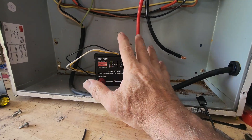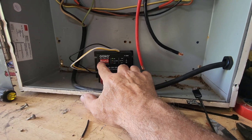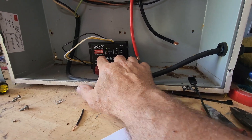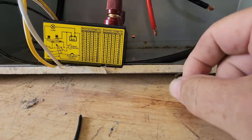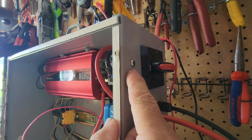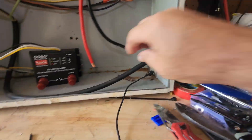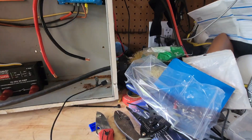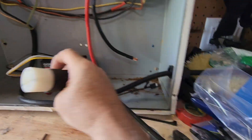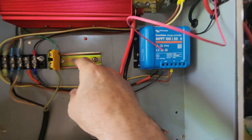I have it set to shut off at 10 volts and turn back on at 13 volts. The dip switch settings are: the first four are for the cutoff and the last four — five through eight — are for the reconnect voltage. The side of the unit gives you a little chart telling you what to set. I also added a pilot light — the output goes to a weathertight receptacle.